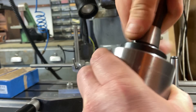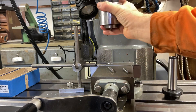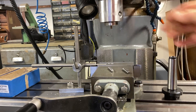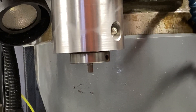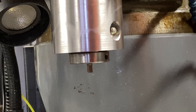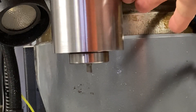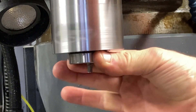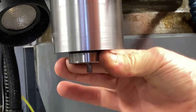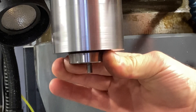I'll load this into the milling machine and show you the wobble that you get. You can see the main body is running concentric but there's a wobble on the tool. Because it's in bearings, I can hold this and you can see the actual movement the tool is making — it's an oscillating movement.